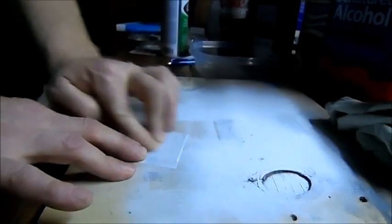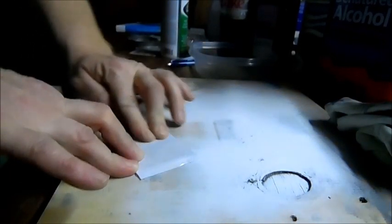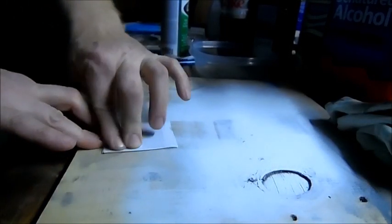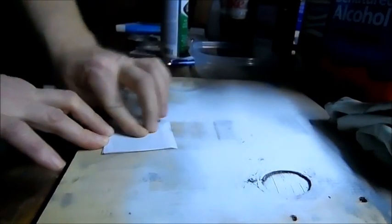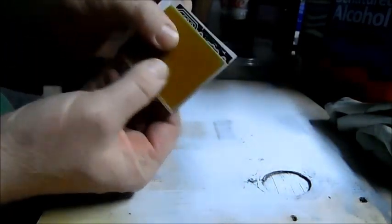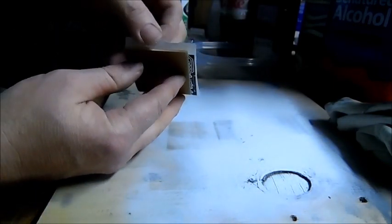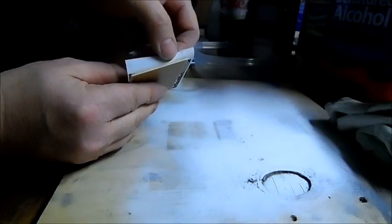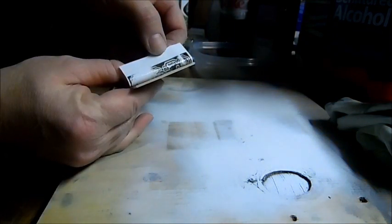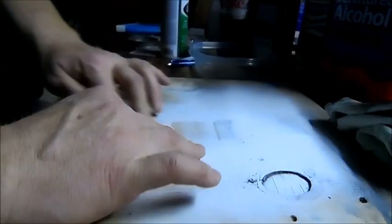The reason this works is because the toner will transfer onto the lacquer really solidly — it makes a nice transfer. Then we'll go back and wipe off the lacquer with some alcohol. The printer toner is not soluble in alcohol, so when we use the alcohol it will only dissolve the lacquer in the areas where the lacquer is exposed and leave it just how we want it for our etch. You need to rub it really good. What would happen at the perfect timing is the paper would just lift off and leave all the toner on there. If you keep it lined up, you can lay it right back down and rub over it a little bit more.